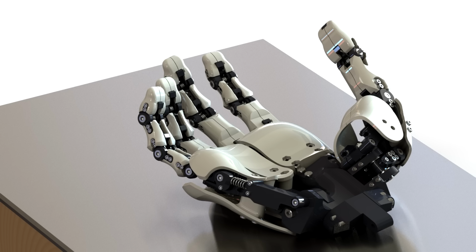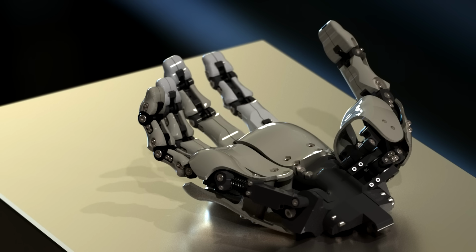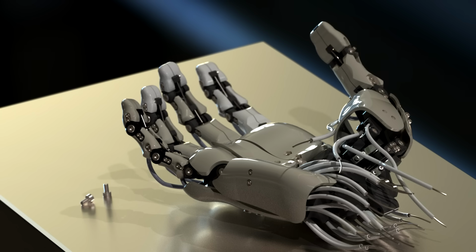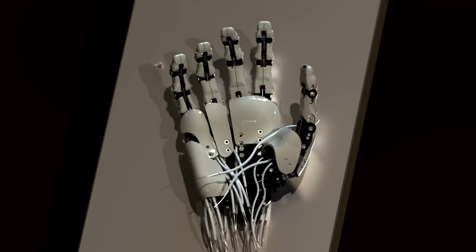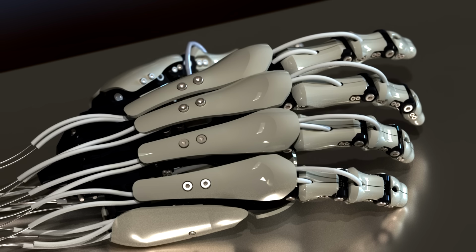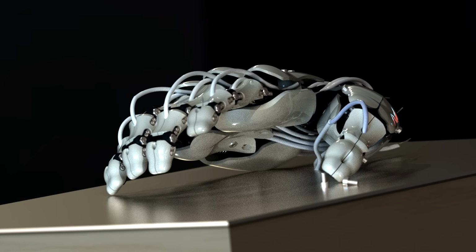But regardless, there'd still be some problems with the pulley mechanism, and most of them you could make a lot better just by using tighter tolerances between the inner cable and outer sheath, things like a better pulley and a better securing mechanism on both the pulley and the point that you're actuating. There's a million little tweaks that you could make that would make this a lot better, but in the demonstrations it did seem to work sort of okay as a proof of concept, you know.